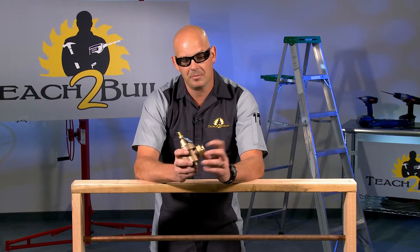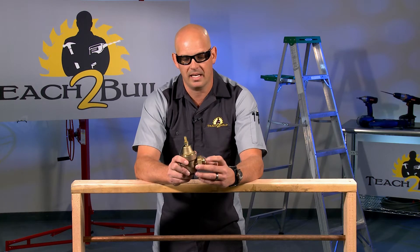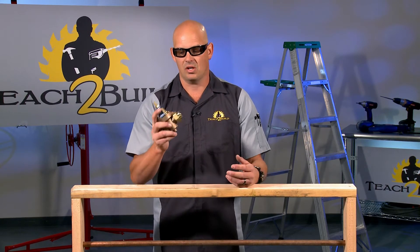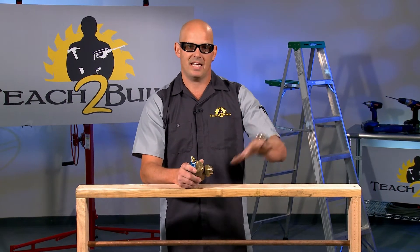There are a number of problems that high pressure causes. These regulators are not that expensive — $34 or $35 for the unit itself. You'll need to buy the adapters depending on whether you have copper or PEX or whatever your supply line is. The most important thing is to find out where to put it. If your water supply line comes out near your water heater and branches off towards the cold supplies, that's a great location. But if the line goes straight to the water heater with no branch offs, the cold is already branched off — installing it there will only adjust pressure on the hot side. In that case, you'd need to go in the crawl space or dig out a section of the line in the yard and install it there with a meter box.